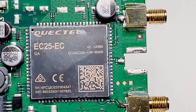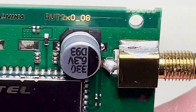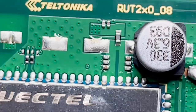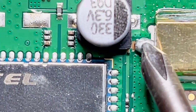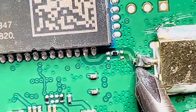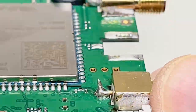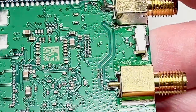Look what we see here — somebody already tried to fix it, but without success. The center pin is not connected to the trace — it's broken. Same here. And even worse, this one is connected to ground. Oh my god, somebody tried to do something without having the correct equipment, and that's it.